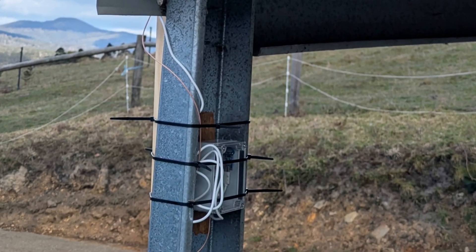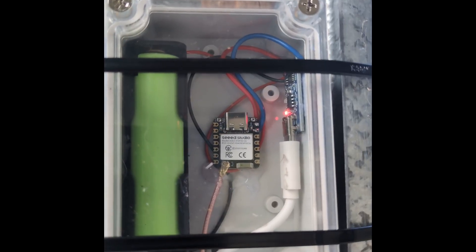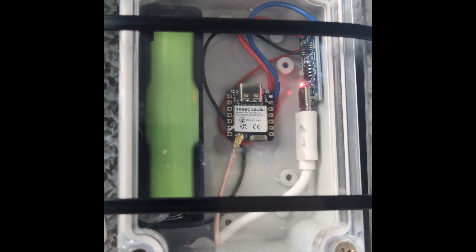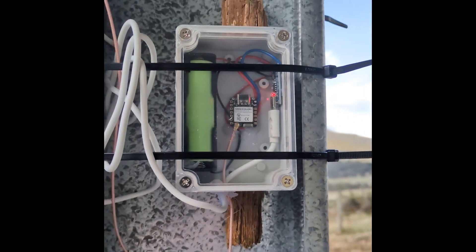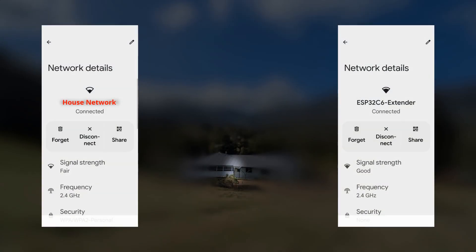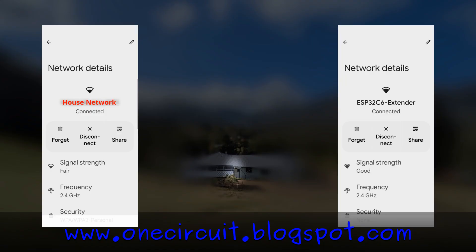But look, it's working. Up in the paddock, the house Wi-Fi is barely ticking over, but the extender is going really, really well, particularly when the sun's out. That makes me think I should have put a big capacitor across VCC and ground, which is what I did for the ESP8266 extender — I don't know why I forgot on this one, but that certainly helps. Probably the sooner I go to two batteries the better for power delivery. But proof of concept — it's working pretty well and I think we can build on this. Thanks for sticking around for the journey. That's the circuit working for this week — see you next time.